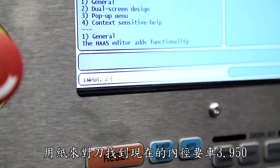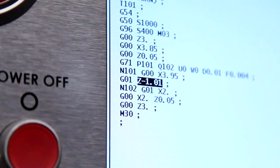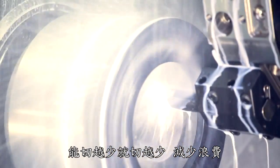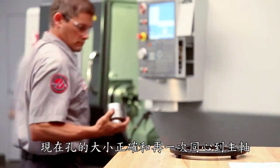We will also change our jaw cutting program to skim cut into the back face ten thousandths deep, to clean up this face as well as the main bore. Always skim cut the jaws for complete clean up, but keep material removal to a minimum to get the most life out of your jaws. Now they are the correct bore size and once again concentric to the spindle.